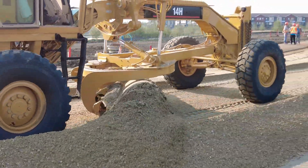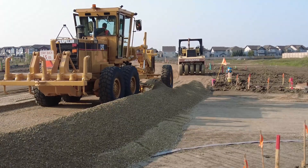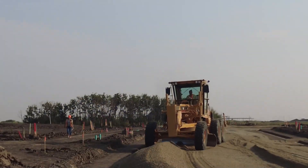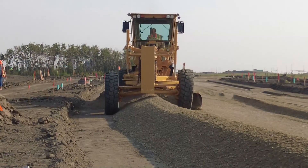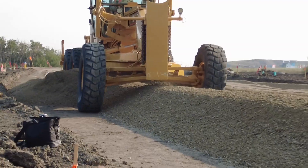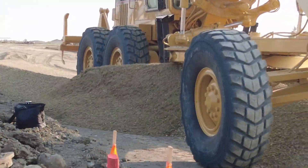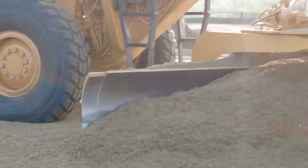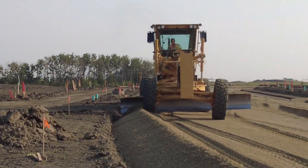This is standard general's own gravel — it's 20 mil gravel, very nice stuff to work with, it packs really well. We'll place this stuff 20 centimeters thick, because eventually once it's all trimmed it'll be 15 centimeters thick. We're going to leave a little bit for the trimming head to trim off, so we're going to grade this stuff at five centimeters high.